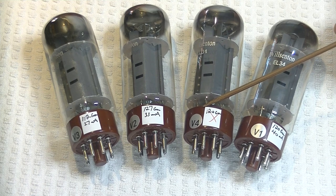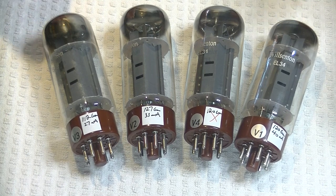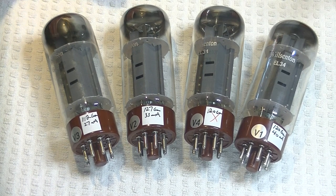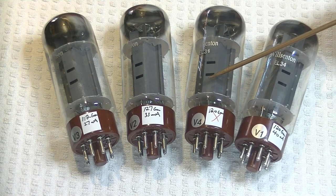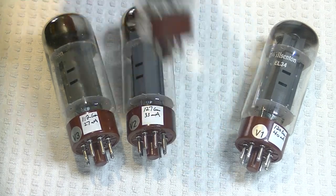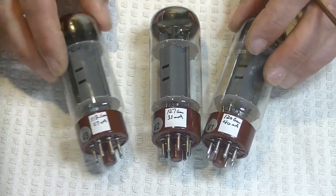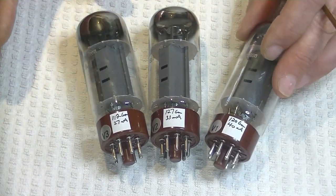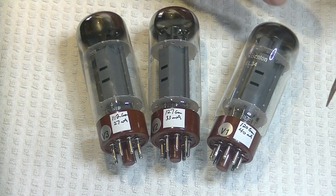Now, it burnt out on the tester. You might say, whoa, maybe your voltages were wrong. No — I've got all my voltages staring right at me on my tester. They're all fixed, controlled, regulated. I can see what they are. There was no problem with the voltages. This filament burnt out probably right in front of my eyes. Garbage. Brand new tube. When that happens, that always calls into question the quality of the rest of the tubes. So let's look at how they test.